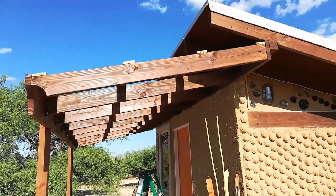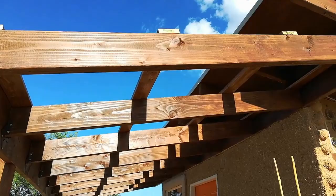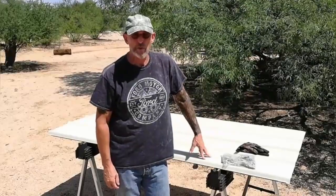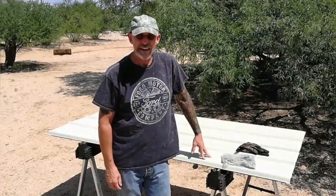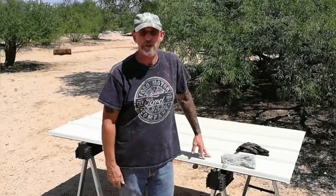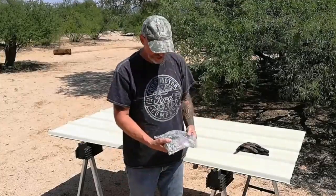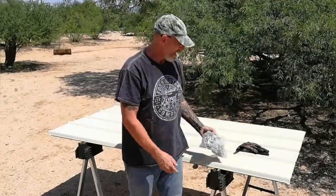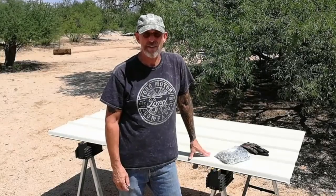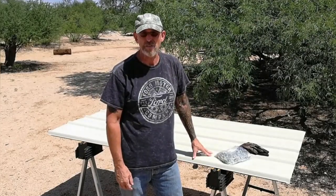I really wanted to get this done today and I managed to do it. I got the purlins installed, 24 on center, and good to go. It's Saturday morning and I just got back from picking up our metal roofing for the overhang. I got five sheets, 80 inches long. There's going to be a little bit more that I'll have to cut from a remainder piece from our original roof using an angle grinder. I picked up five pieces 80 inches long, 150 screws, and this cost $113 including tax — I believe it was $2.75 a linear foot. It's 29 gauge with a painted colored surface.